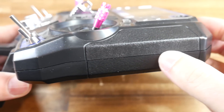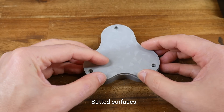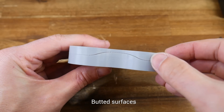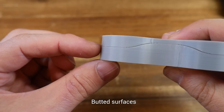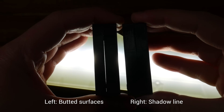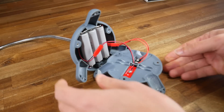In the LumaMate video, some people asked me why a shadow line, so let's summarise. Firstly, some people might find it more aesthetically pleasing, but obviously that's subjective. Secondly, the overlapping lips of each half help them self-align, which might aid assembly in some cases. Third, a shadow line is much more forgiving when the mating surfaces don't quite match, as we can see in our examples. And finally, the two parts will have a tighter seal, keeping out dust, moisture and light — depending on the object, this may help with durability and reliability.